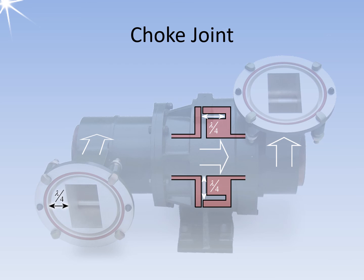Although both waveguide parts have no electrical contact, the wave sees an ideal short circuit for the high frequency at this point. Possible DC contacts via the metal housing lie behind this short circuit and are negligible. The flanges for connection to other waveguide sections are also choke connections.